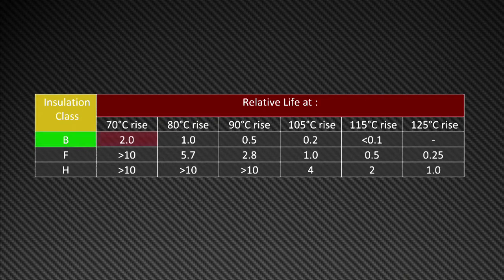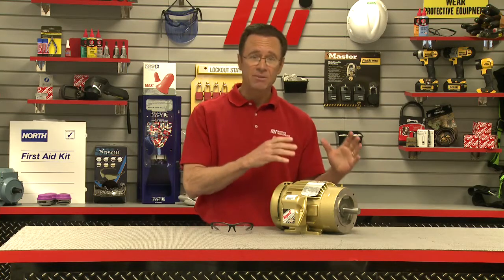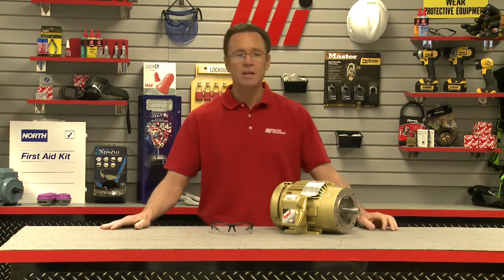The relative life figure shown here is a fair indicator of the application latitude available to the motor user. A motor with a class B insulation system has a given life expectancy that is halved for every 10 degrees above the reference point and doubled for every 10 degrees below it. The user can trade some of that life expectancy for the option of being able to overload the motor depending on their needs. With a proper understanding of the service factor, your application requirements, and the environment, you can select the correct motor to get the job done without oversizing.